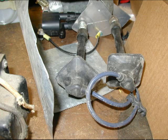Here you can see the 2-tower 4-wire coil near plug pack that is being tested. This one is from a 1990s era Toyota RAV4. It is connected to the 2 spark plugs that you see in the picture. They are simply screwed into the arc-shaped aluminum plate. Notice the long sleeves that connect the plug wires to the plugs. On the bench, this arrangement can generate a lot of RF noise that can reset the Arduino, and that's why I have the metal shielding in place.